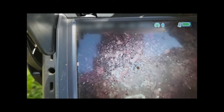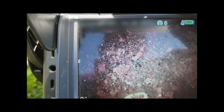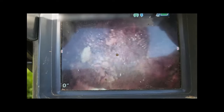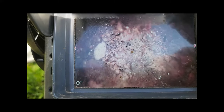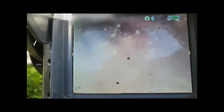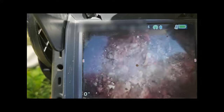What we have is a slab leak, but this one is actually a tricky one because the leak is actually — if you can see — the water is running through the sewer line. So somewhere under the slab is blocked, and you can see the water constantly running. No toilets or anything is running, and you can see it constantly flowing, so that's a pretty large-sized leak.